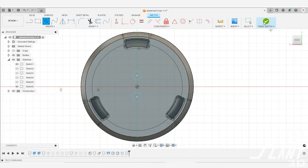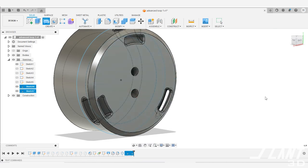You can expand this as much as you want. These cut diagonally through the corner of the part. But if you want something very flush and consumer-focused — like for a tassel — you might do something that looks like two holes but is actually a loop going through into the part and then coming back out. You could push a paracord or anything else through it for a very strong fit, a flush fitting, and a smooth internal connection so you do not fray or wear on whatever the clasp, tassel, rope, or string happens to be.